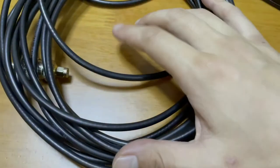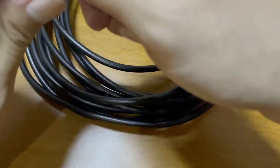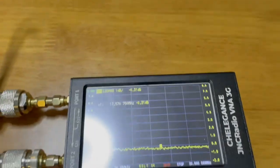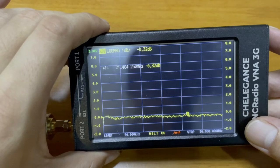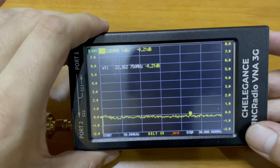And now we're looking at the second cable in our experiment. The very same process — I will just speed it up. Okay, let's take a look at the results. Looking at the results, the two cables are both working fine, at least in the frequency range from 50 kHz to 30 MHz. Today we've learned how to use the JNC Radio VNA to test the performance of a coax cable, and my experience is that both of these coax cables are doing a very good job in terms of cable loss.